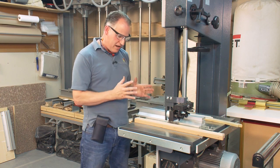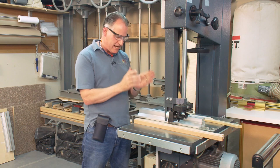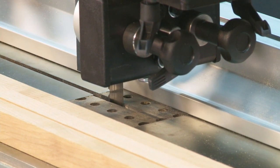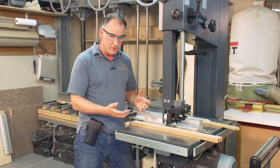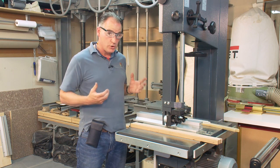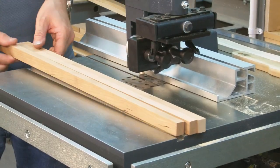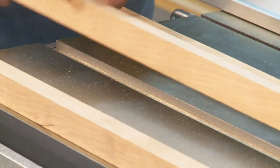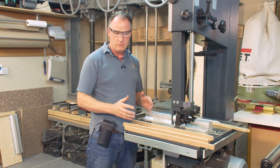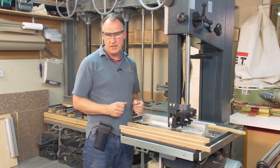So I don't have to spend hours and hours measuring, trying to move it. Trying to measure exactly where a bandsaw blade is quite difficult because you're trying to measure a particular tooth. I normally leave my timber oversized, probably at least 1/8 of an inch, possibly more than that, for us then to go and do the planing work, because they have probably bent and warped a little bit because, again, we've been releasing tension. So I will let those settle before I go on to the more accurate machining process.